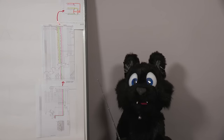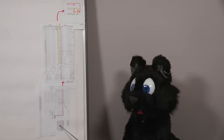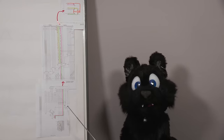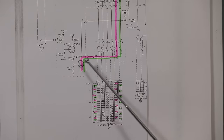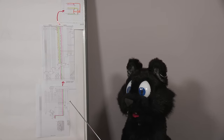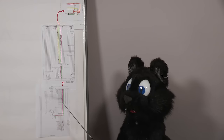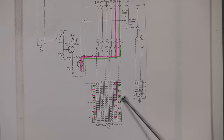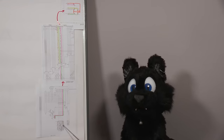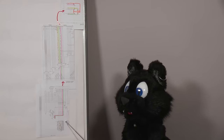Internally, the signal switching is done with the various drum switches. But as side information, these also set a few data lines to ground or floating. Think of them as digital signals that are either unset or set, where floating is unset and grounded is set. For example, the vertical display selection has a line for 5x and 2x. If any of the ranges that start with a 2 is selected, the 2x line is pulled low. If any of the 5 ranges is selected, the 5x line is low. For the 1 ranges, both of them are left floating.